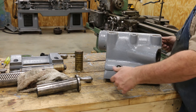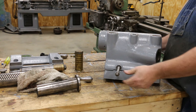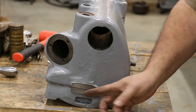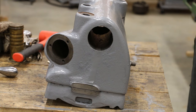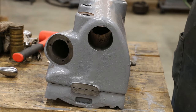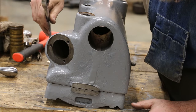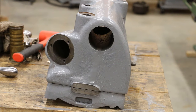Next, we are putting the rod in that will thread through that little boss in the middle. Basically you tighten and loosen this and it will slide the whole top casting from left to right. If you look on the back of the tailstock, there's a little machined area with a scale — it's literally a scale, marked zero in the middle, with one inch and increments on either side. This is so you can see your measurements as you move the tailstock left to right, use it to turn tapers, or correct for any alignment error. By turning the screw on one side you can see it moving the tailstock, and once you get it where you want, you tighten up the nut on the other side to lock it in place.